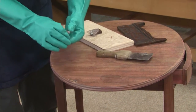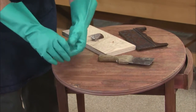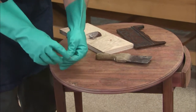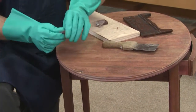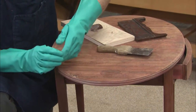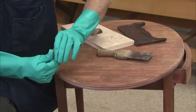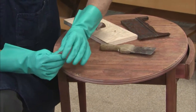This is a piece from the 30s or 40s. It's a veneered piece, and you can see right here on the edge, come right on in here, where the veneer has really busted out. Now I could use a lacquer burn stick to fill that, or I could use this epoxy. Anybody can do this. A burn stick, well, that's an art.